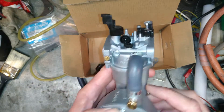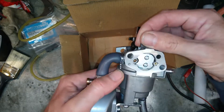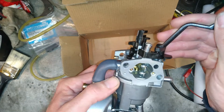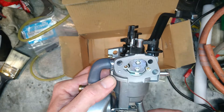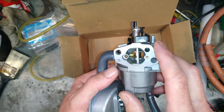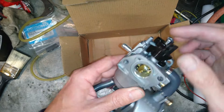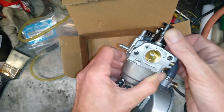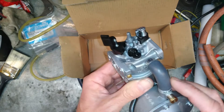We'll run through the basic operation of the carburetor. This is the intake side which comes from the air cleaner, and the little plate there is the choke plate. It comes with the lever the same as what's on the generator — choke off so you can see right through the carburetor, half choke, full choke. You use that when you're starting it on petrol. This is the petrol feed from the fuel tank. It comes through a series of jets, and this is the throttle butterfly which is hooked up to the governor on the generator. This is the idle screw — throttle plate closed — and you can set the idle with the idle screw.